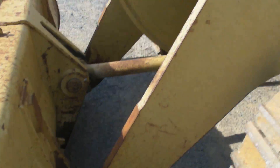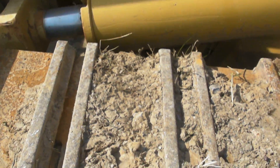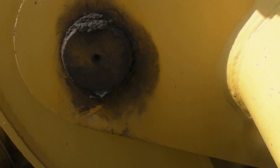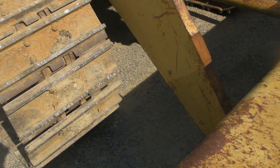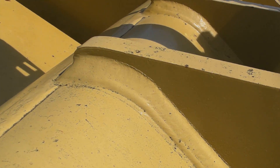That's the bucket. There are two main cylinders that raise the loader arms up. The cylinders are very heavy-duty — we always look to make sure that the pins don't have major play in them, especially the main pins. This is the main tilt cylinder for the bucket. As you can tell, everything is very heavy-duty on this machine with lots of heavy-duty welding.